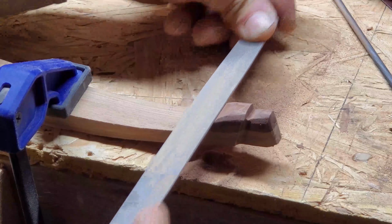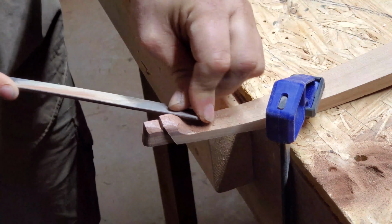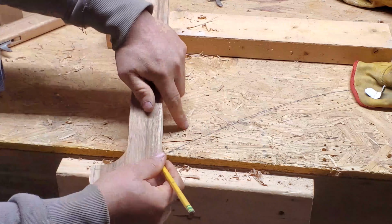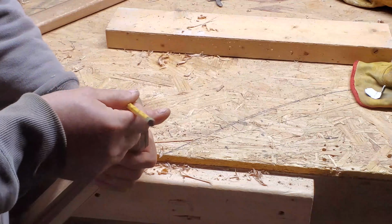Notice that the last 6 inches of the bow limb have been thinned down from 4 flitches to 3 to get a more even bend in the bow. Finally, the string groove was deepened and refined using a small round file and then hand sanded to a nice polish. The stock was cut from a 1-inch by 3-inch hickory blank on the bandsaw.